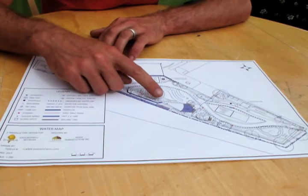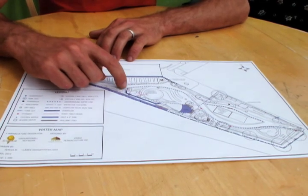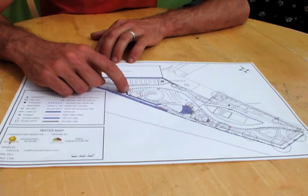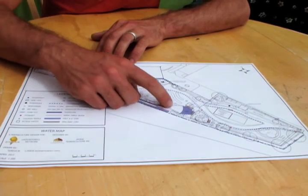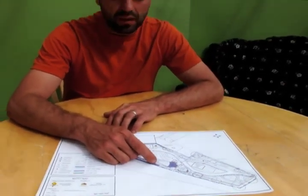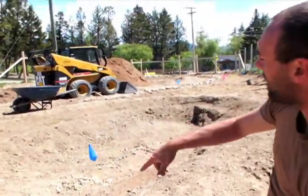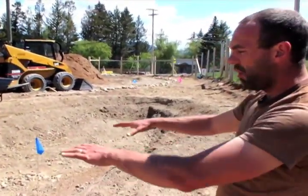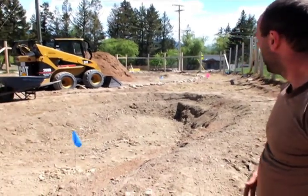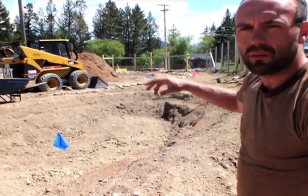In addition, we have two underground water cisterns that currently just overflow right where they are. We're going to reroute that overflow so it moves through a pipe and also goes through this pond. So this pond becomes a very central component — it's aesthetically pleasing, and it's going to have a constructed wetland on this side which is going to clean the water. We'll have a whole bunch of native riparian species in there with a small amount of exposed water on that side of the pond.